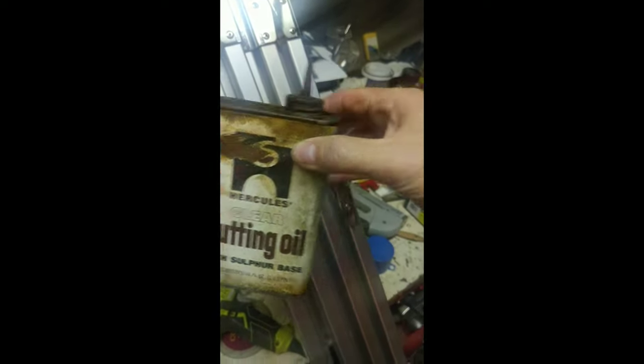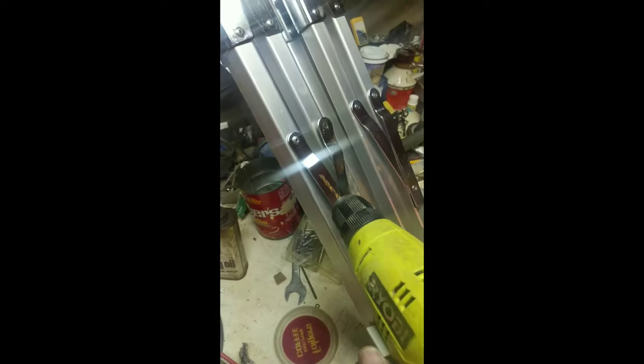This one's fine, and the others on the other side are also starting to bend just a little bit, but I'm going to repair it. What I'll need to do is use this cutting oil, and I'm going to drill out the rivets here, like I've already done one. I'll just do another one here, put it on the vise and straighten it out. Hopefully I can get these brackets to not bend anymore.